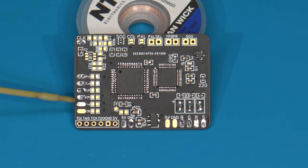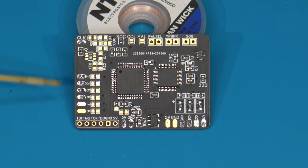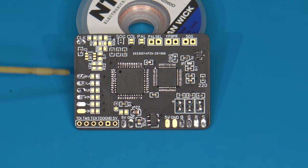Over here on the left-hand side of the board, these are actually the input signal pads. So you will be attaching wires off of these pads to the color chip marked as U10 on the Intellivision itself in some various places. Now you'll notice that we already have some pads tinned in place for the ones marked 2, 3, 5, 6, and 7. 8 is not tinned up. That is because we don't need 8. We only need the first 5 at the top here, 2, 3, 5, 6, and 7. However, these numbers do not actually correlate to the chip numbers or to the pin numbers that you will be soldering onto on the color chip. Just basically ignore these numbers, but you'll need to keep track of which wire goes where, for instance, pad number 2 here. You'll need to track where you've got that soldered, 2, 3, 5, 6, and 7.